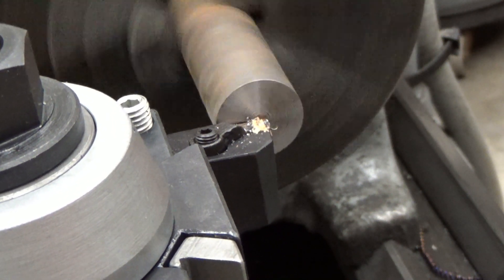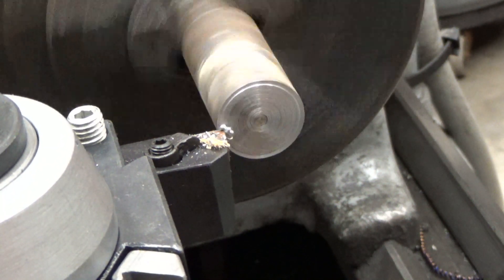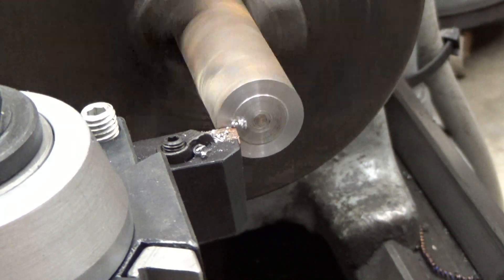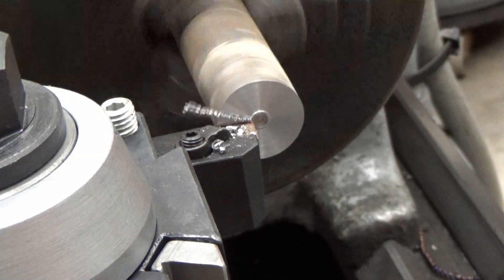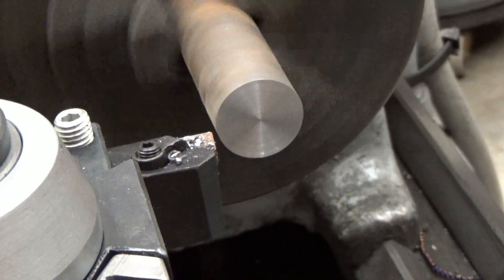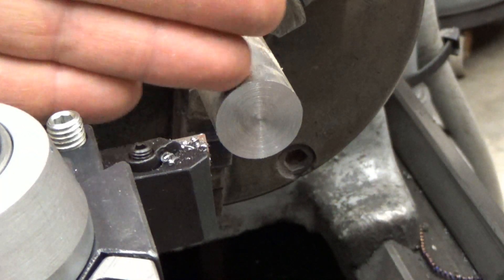So we turn this on, running about 300 RPMs, and I can manually feed this in using the different hand levers. In this case I can move that cross slide in and we're just slowly going to be taking away a little bit of material, cleaning up that face cut. We're operating just a little bit high above center. We're turning real slow on that cross slide and ideally we try to maintain a consistent speed of operation. That's a basic face operation done 100% manually just by feeding it in, and we're getting a pretty decent surface there.